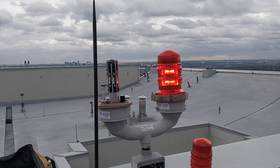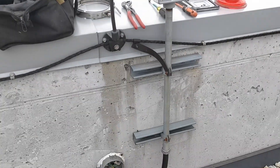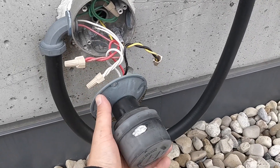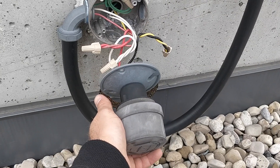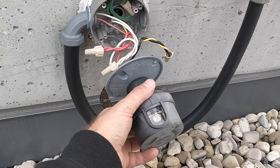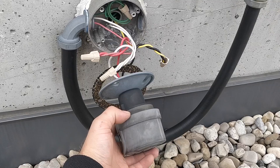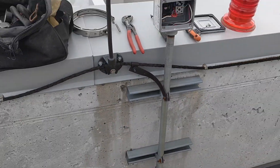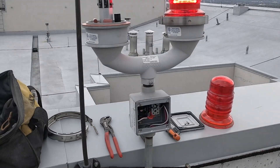Normally you will have one light on, and these are controlled by the photo cell. The photo cell has them on even during the day — I covered it, I even took it out, and it's nice and bright outside today. I don't know why it's still on, so that photo cell is probably faulty because it should be on only at night when there's low visibility.